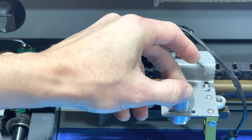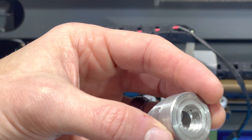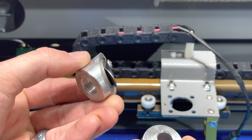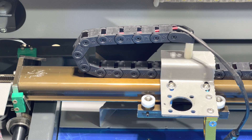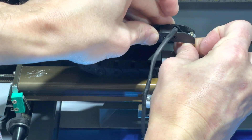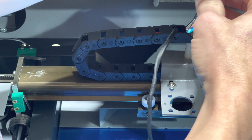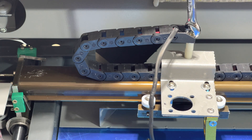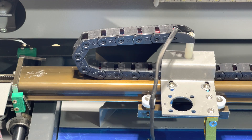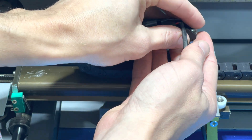Next just grab hold and unscrew the two halves. There is a mirror included on top of the original head, but the new replacement head does not include a mirror, so we're going to add the mirror to our new laser head. Looking it over, the original isn't very nicely machined — got some little metal bits on it. In the box of parts that comes with your laser you have a double-ended wrench to remove the little top fitting. With that loosened we can pop it off and lay the drag chain nice and flat.